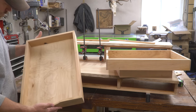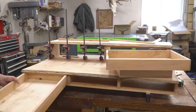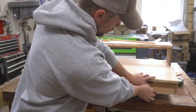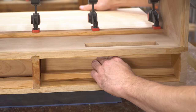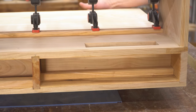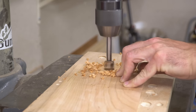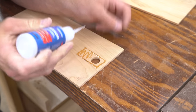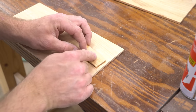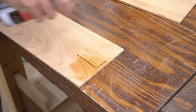I built some nice drawer boxes off camera. I wanted these to be removable — more like bins than actual drawers. They have a little bit of relief so they can slide smoothly, but they're tall and deep enough so that they won't tip out by accident. To keep them from pushing past flush in the front, I glued some stop blocks in the back. The sliding cubby doors needed a finger hole to make them functional, but I didn't want to be able to see through the hole, so after drilling I glued a very thin strip to the back side using CA glue. CA glue comes up a lot — it's a staple in my shop, and if you're ready to add some to your workflow, follow the link in the description and use code UNFLINT15 to get 15% off your order.